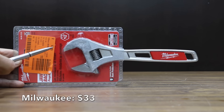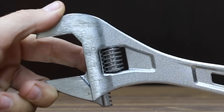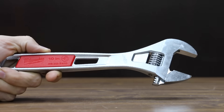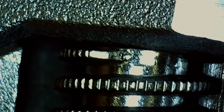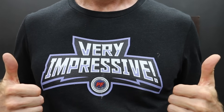Also at $33 is the Milwaukee brand, made in Taiwan, featuring a proprietary adjustment screw, a 6-thread knurl, parallel jaws that won't slip, and a laser-etched ruler. It weighs 491 grams and has only 0.71 millimeters of up-and-down slop and 0.13 millimeters side-to-side. Milwaukee claims their wrench won't back off — and they deliver: it moves into first place, giving up only 0.27 millimeters. Very impressive.